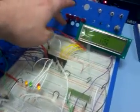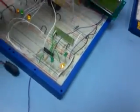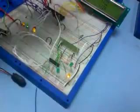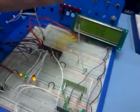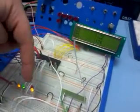There's a disarm button here. There's a reset or the learn button here. This is so I can learn more sensors and encoders onto the system. I can learn 7 initially, and if I add EEPROM onto my decoder chip here, I'll be able to add a total of 32 devices wirelessly.